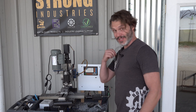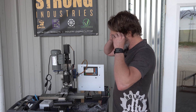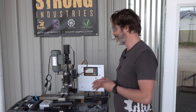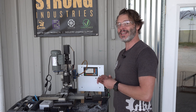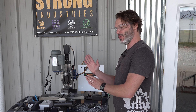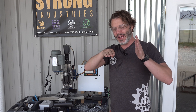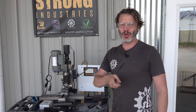I'm going to put on my safety glasses first because this is dangerous doing interrupted cuts. I'm going to make sure that my bit is more or less centered. Having this x-axis where I can float my bit forwards and backwards is kind of bad because it can make me lazy and not get enough relief cut on the backside of my cutting tool. So your cutting angle, instead of coming in and chopping at 90 degrees with relief on the back, I'm actually cutting it like at 45. But it's a carbide bit and it has a really big hook to the side of it too.